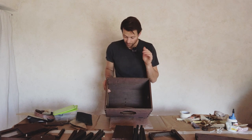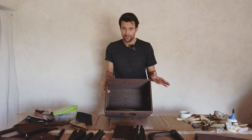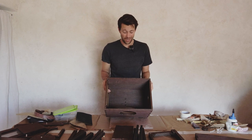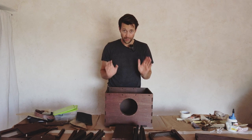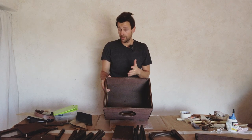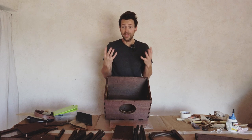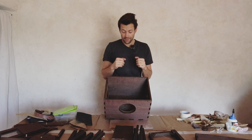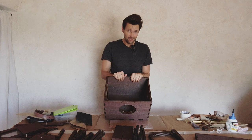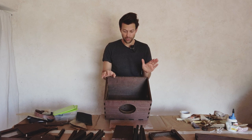The chemicals will sink into the wood and never leave, so I'm going to place a first coat of varnish on the inside, put it on the side, then varnish the inside of the lid, and then start with the tripod pieces because those should be varnished before assembly. If you are planning on painting the camera in your own color, still varnish the inside with a clear varnish — or use black paint, since darker insides absorb light better, giving a safer environment for the photo paper.